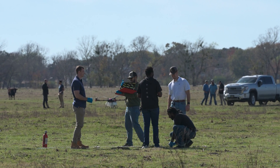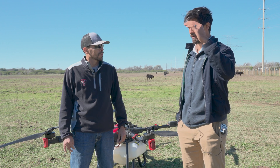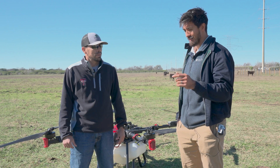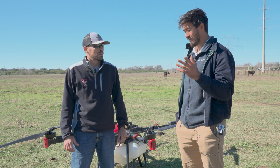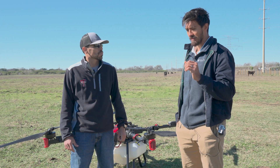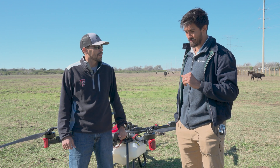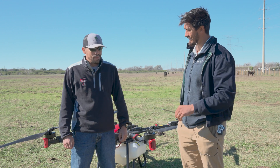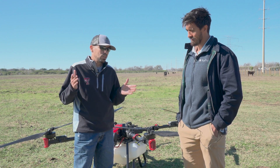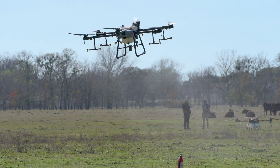From fastest to slowest on the 40 acres: the Helio AG272 did it in about 49 minutes, the XAG P100 Pro on its final run did it in about 68 minutes, the Helio AG230 did it in about 73 minutes, the DJI T40 took about 90 minutes, and the DJI T30 took about an hour and 40 minutes. I kind of suspected the DJI T30 being at the low end, just because we knew the swath was going to be a lot narrower and it definitely did not have the speed compared to the other drones — though in the spray test it still performed very well.